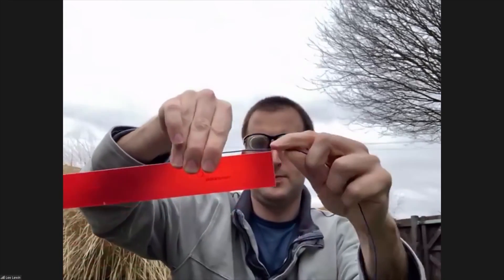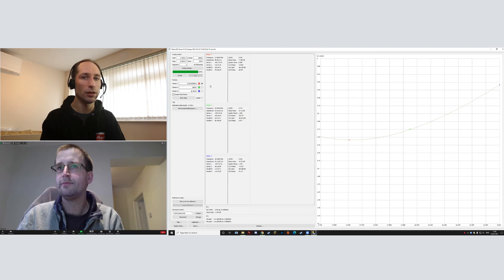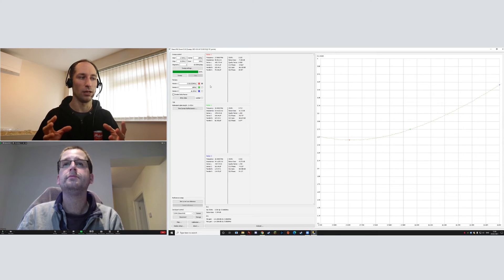Make sure you cut that off one side and then the same off the other side — keep both legs equal. Let's grab some wire cutters and head outside. I'll take about 10 centimetres off each end, measuring with a ruler. About 10 centimetres — there. Now doing the same on the other end. The reason it may not be at the expected frequency is partly the height above ground; a lower aerial will be resonant on a different frequency. Ideally the centre of the dipole should be at least a quarter wavelength above ground — about five metres for a 20 metre dipole.